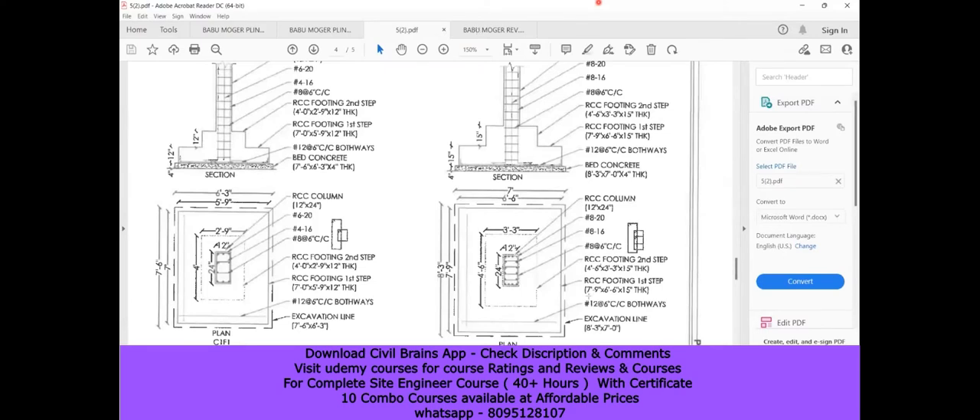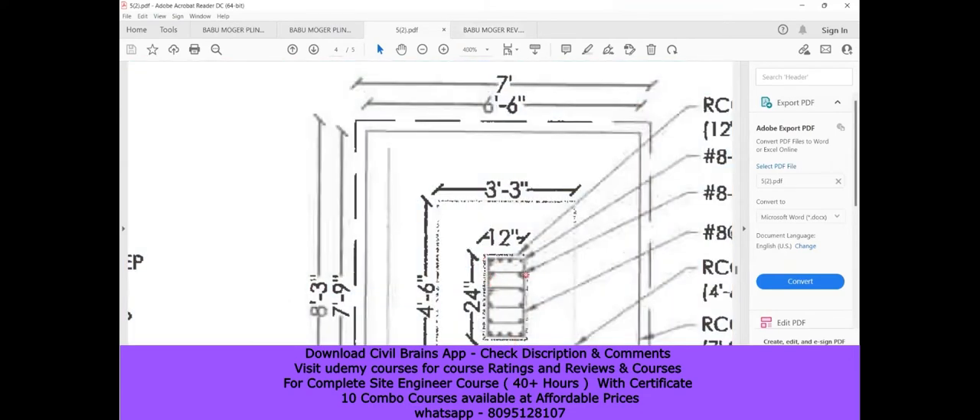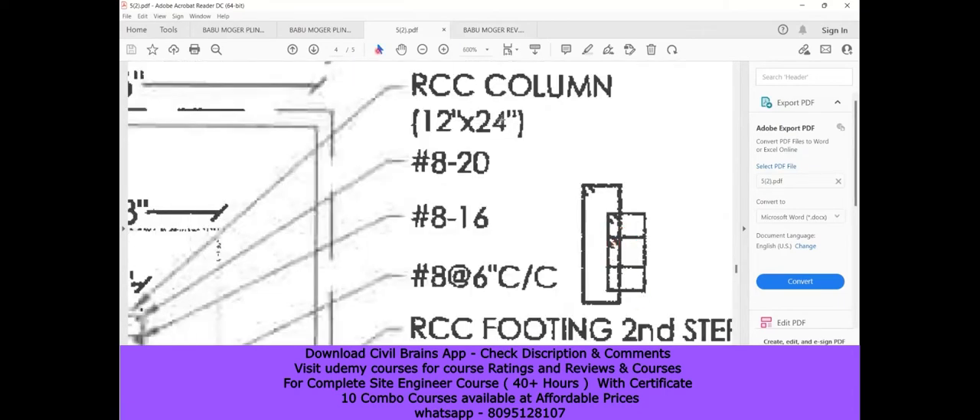So the correct arrangement is: one ring goes completely around — that is your master ring. After that, the next ring connects in one direction across the column bars, and the next ring connects the remaining bars. So three rings total: the master ring, the second ring, and the third ring. That is how the lateral tie arrangement is done for C2F2.